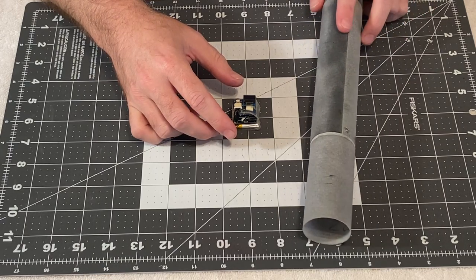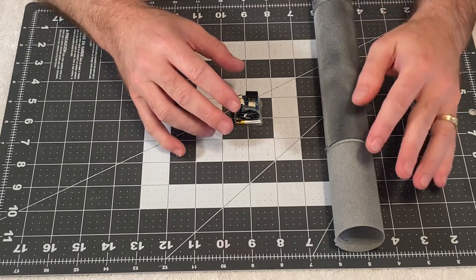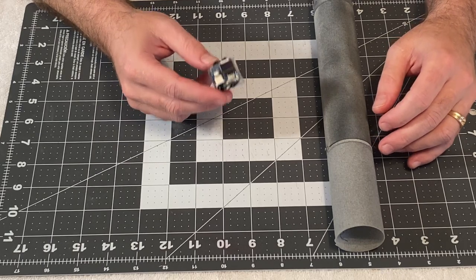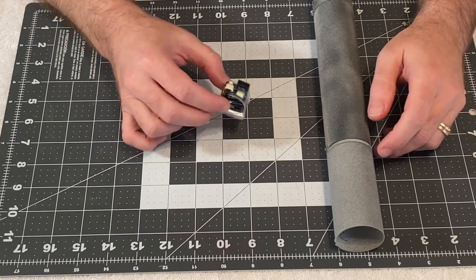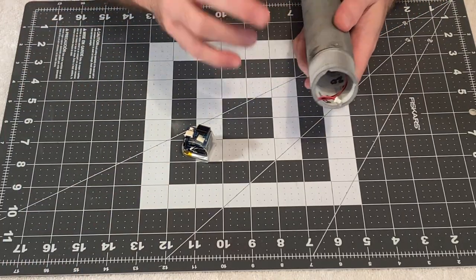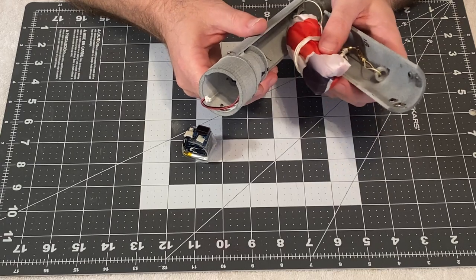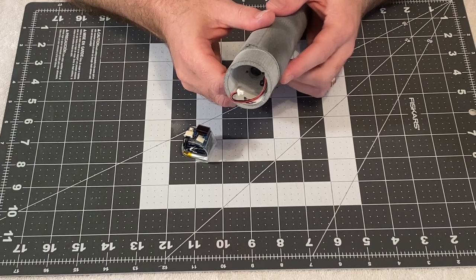This is a prototype of a new design from a very good friend of mine, and he's asked me to start doing some testing on this equipment. I've already been doing some testing on the RPM — the Rocket Performance Monitor. It's an accelerometer-based altimeter, and one of the cool things about it is that it has the option of hooking into a servo motor, which will activate at apogee to release a panel and deploy the onboard parachute. It's not barometric in any way, shape, or form.